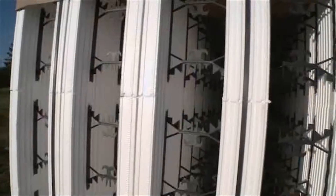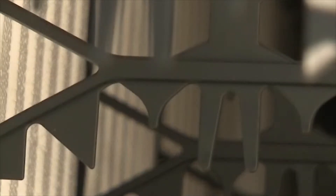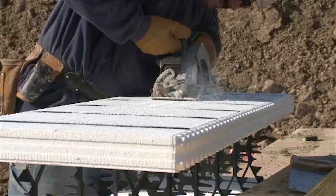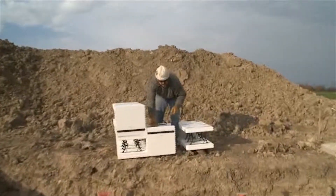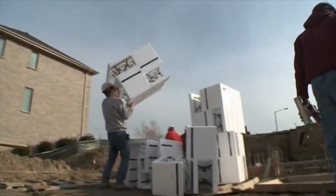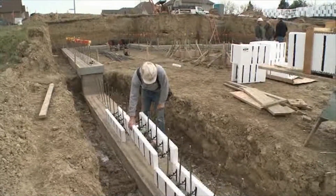The Insulated Concrete Forms are two sides of insulated styrofoam, and then on every eight inches there's a nailer that holds from front to back on the styrofoam that makes up the Insulated Concrete Form itself. On the blocks themselves, the ICFs — not only are there nailers between the black tabs, but there are one-inch increments in between as well. You have to cut on those one-inch increments to keep your black lines all in a row. Once the project is complete, you'll see that all the black lines are in a row, which helps for keeping everything straight for drywalling, nailing, or screwing — and for finding those black tabs to nail or screw to. Staying on those one-inch increments will always keep everything in line.